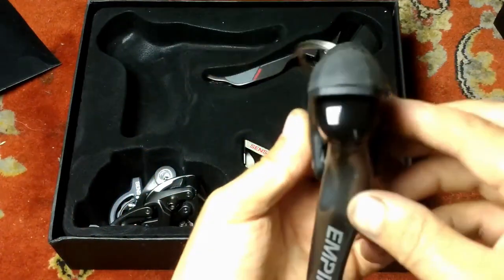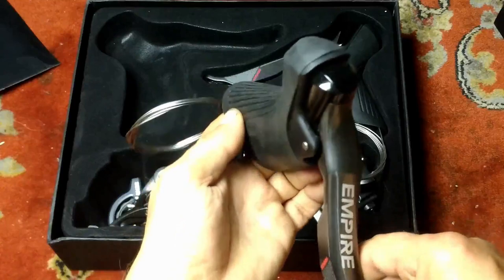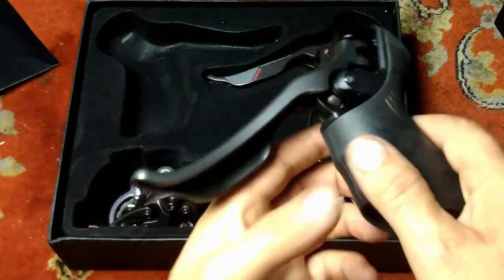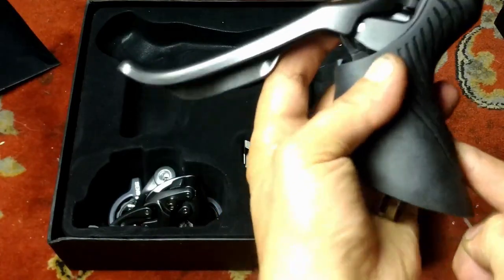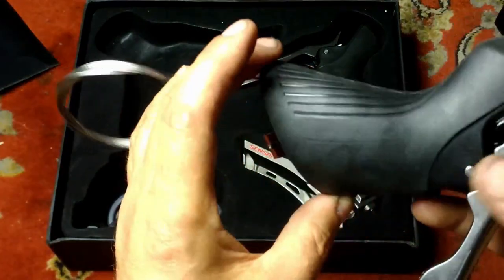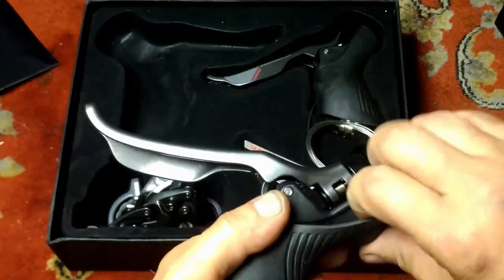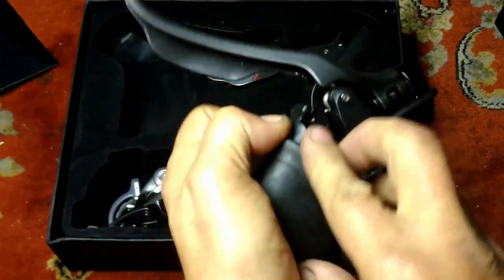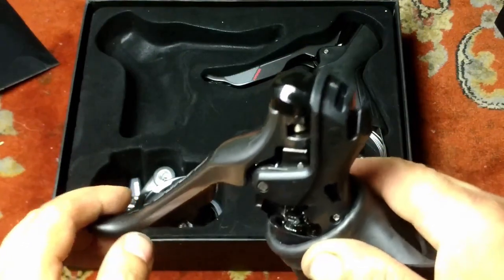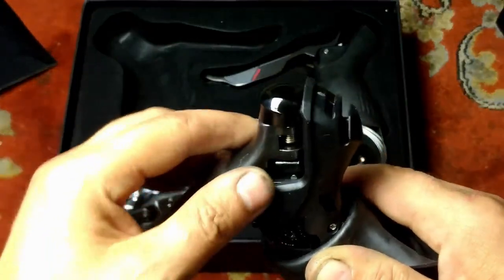Now the levers are interesting. They look very Shimano. You get three clicks out of it that way, single downshifts of course being an escapement mechanism — downshifts as in releasing the cable. So the lever is basically Shimano on the outside and SRAM on the inside. That mechanism in there, kind of covered in grease, it's pure SRAM — but actuated via Shimano's lever arrangement.